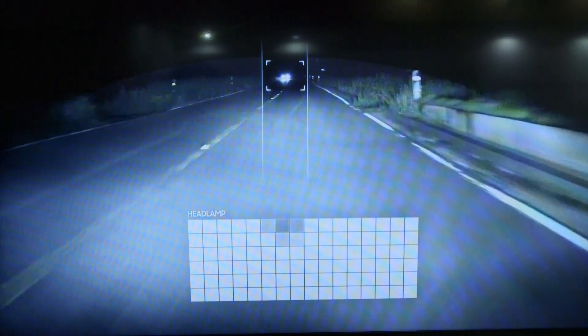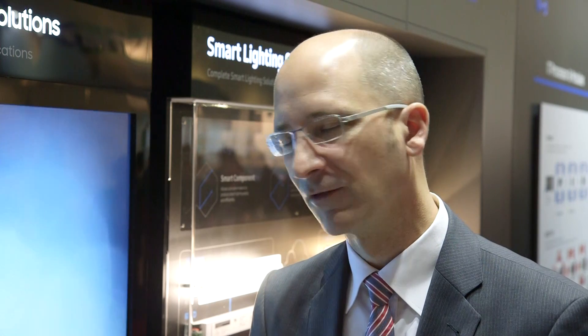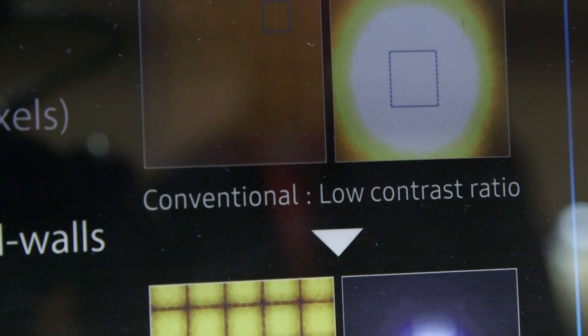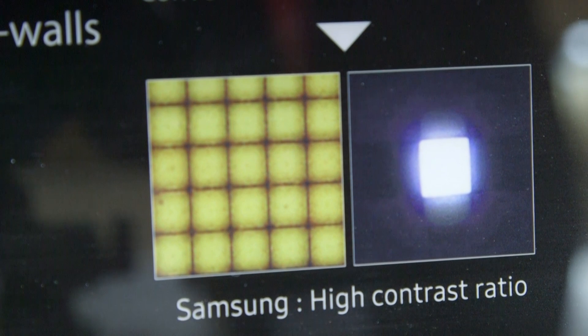In comparison to the conventional discrete LED array, here we have one array taken directly from the wafer. On a 4 by 20 millimeter area we can accommodate roughly 192 pixels. A specific feature is that it's built on a silicon wafer — we keep the silicon walls in the array, which shield the LEDs from each other, allowing a very high contrast ratio for a very effective advanced driving beam.